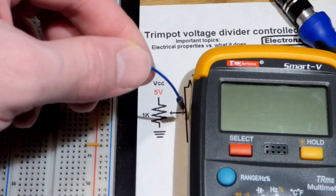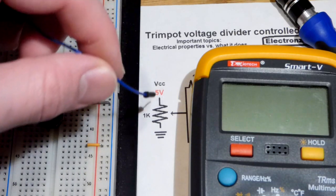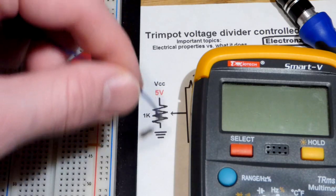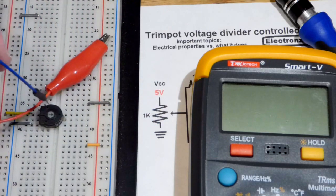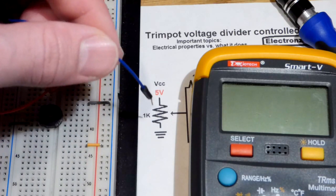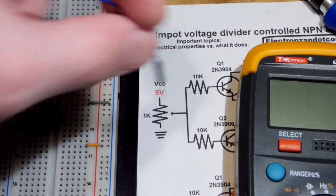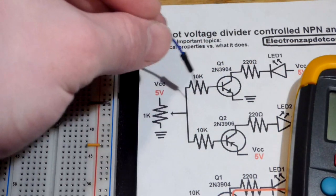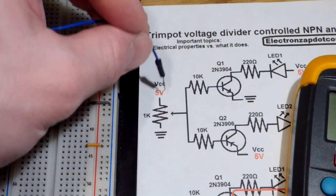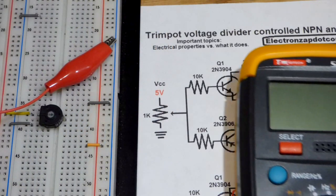The trim pot's schematic symbol is a resistor with an arrow coming to it — the arrow is the output. Normally the trim pot or other voltage dividers have the resistance connected directly to each of the power rails. There's a resistive element within it and a wiper that goes along that element. You can also make it with fixed resistors, as we have in this circuit — a resistor on each side, tapped in the middle, giving half the supply voltage, about 2.5 volts. If we set the trim pot to 2.5 volts, it will even out and basically look like the trim pot is not there.